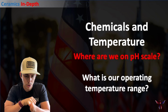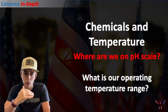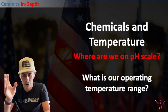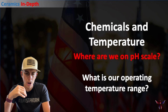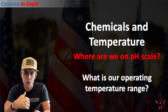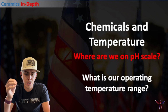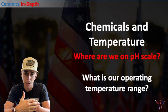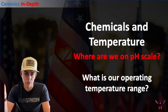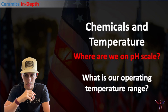So first one would be, where are we on the pH scale? If we're real low, a real strong acid, then we might need to step up into a Novolac, and that's a whole separate conversation. If we're on the high side with like a caustic, we don't really have to worry about it. And then also with the temperature, the ceramics themselves can go up to like 1,000 degrees, but the resin, the binder holding it onto the substrate, that matters, to make sure that the ceramic's holding up, but we're not just tearing it off the substrate and sending it down the system.